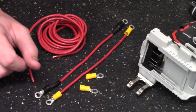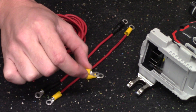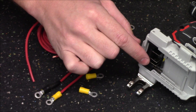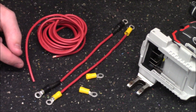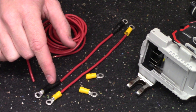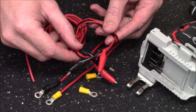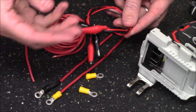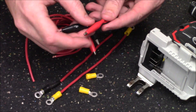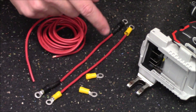The reason I went with ring terminals is that they're completely flat and the same width as the terminals on the bottom of the drill that plugs into the battery pack — so I'll have great surface contact. More importantly, I'm not going to accidentally damage anything. If I had used alligator clips with thin gauge wire, although they would connect the two, they would not be effective at carrying the load and could overheat, or the clips could actually damage the batteries.